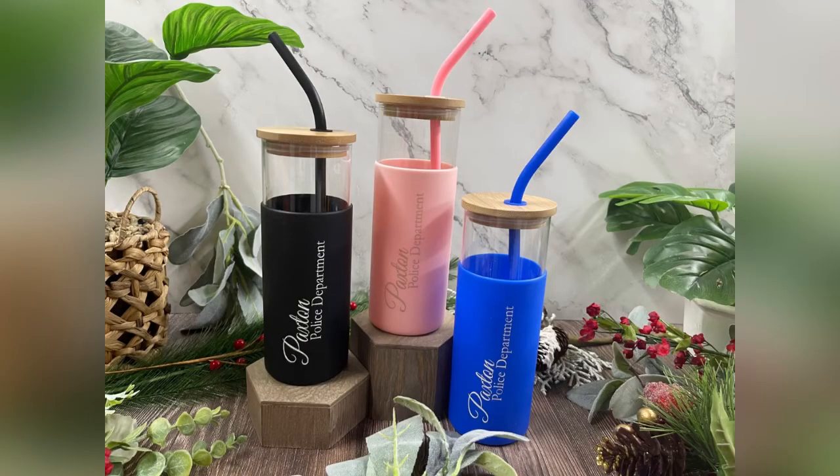Here's a completed photo of the three finished mugs that I just did up. I was also asked: can you do this on a CO2? You can probably get a lot more depth on the CO2 than you can with the fiber — it's probably well worth it if you create a jig for these if you plan on doing a lot of them. But you can do it on either the CO2 or the fiber, your pick. I just did these with the fiber because it's my dedicated rotary machine, and I'm pretty happy with how these came out.